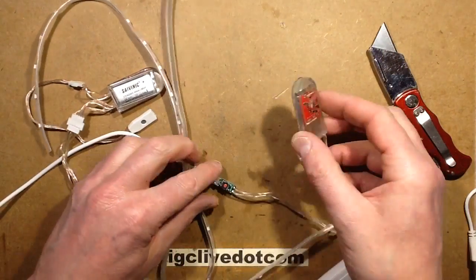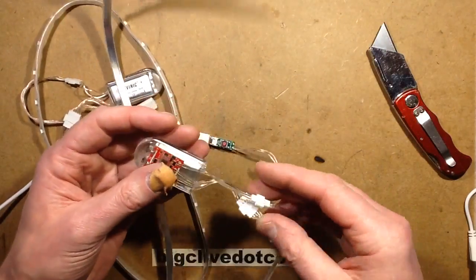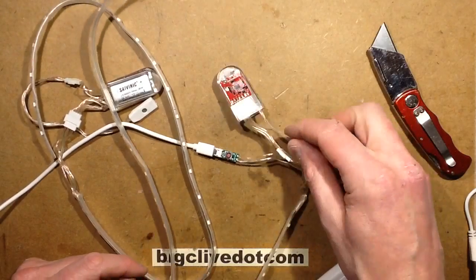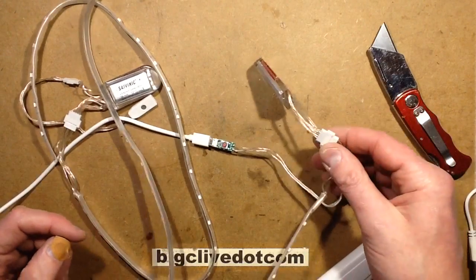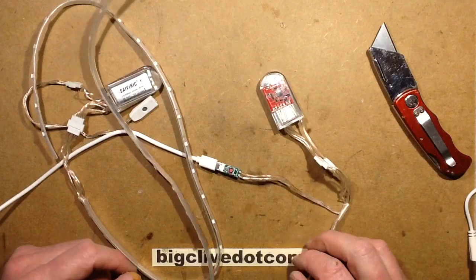As I say, if you have a problem with these, then look at these wee connectors first, because it may just be that, well, the culprit in this case, probably this one had popped off while this shoe was being used, and that just let the battery drain flat and then not take a charge again. But quite a neat little circuit, quite neat indeed. It serves the function.